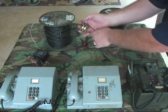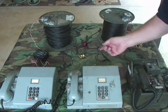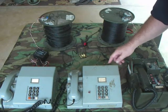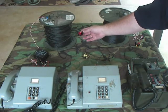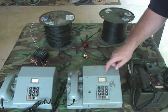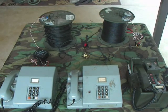You've got two wires that go from the transmit side of each phone to one side of the transformer, and two wires from the receive side going to the same side at different terminals. Then it splits off into two wires. I have 1,000 meters — one click — of two-wire field wire inserted. So from this phone to this phone goes through 1,000 meters, and between this phone and this phone it also goes through 1,000 meters.